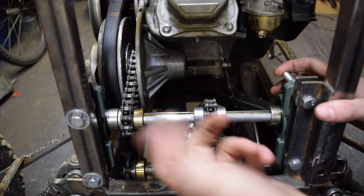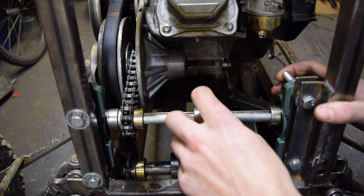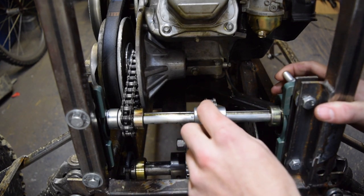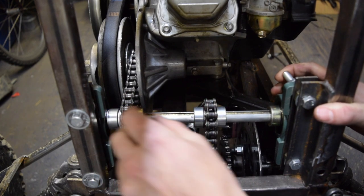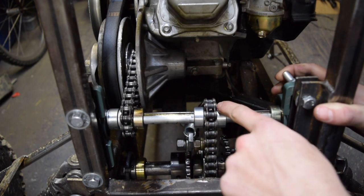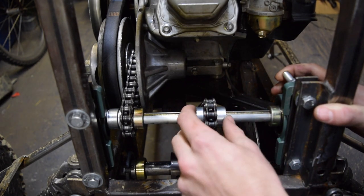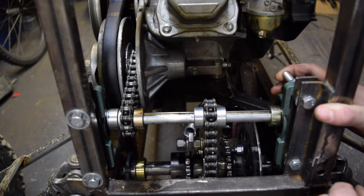The system uses a very simple sprocket design. We have 10 or 11 tooth sprockets, both the same — no gear changing occurring. We have essentially just our key running through the sprocket, trimmed to the width of the sprocket, and then two 5/8 inch lock collars on the outside to prevent it from walking when we are driving.